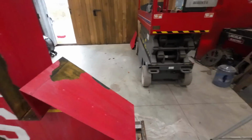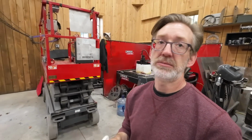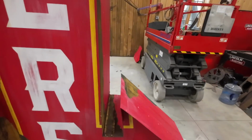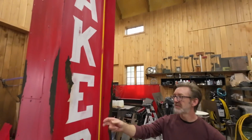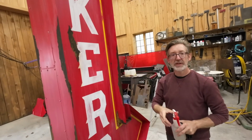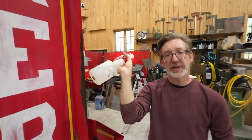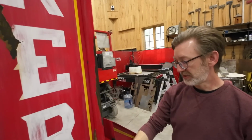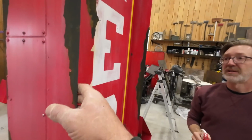How do we make this look like steel? It's only aluminum though. It is an iron paint from Modern Masters. So I apply that, mask it off, paint everything, pull the tape off so it looks like peeling paint, and I spray it with a combination of vinegar and peroxide and salt, and then it starts rusting. So it's real actual iron granulations suspended in paint.